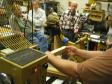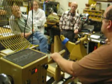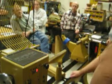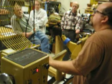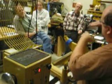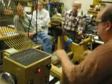When I'm turning bowls, I will crank this thing way down when I'm doing shearing cuts and things, because the tool is where you want it, especially for spindle turning. Everybody teaches their own, but that's typically where we have it. You want to cut above center, because your tool is going to be just above center. You can scrape below center with a negative rake. I don't know if you want to do positive rake below center, because then it would pull it. The burr on the end of that tool is right on the edge at center, but your tool is actually down a little bit. Does that make sense? Anyway, we'll get to some of those details as we go.